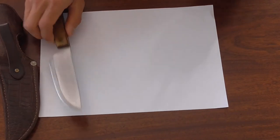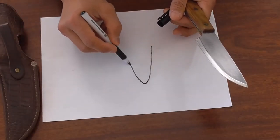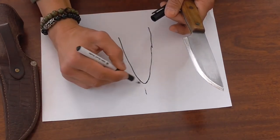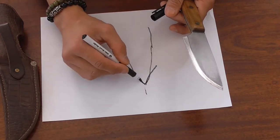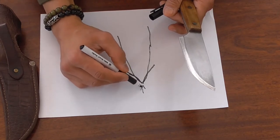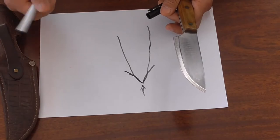When the blade is blunt, if we're looking at it straight into the blade, so if we think of the blade like that, the edge there has been rounded off or damaged. So what I'm going to do is use a grinder to take a bit of metal out and shape it in that shape, and then I'm going to finish it with a stone to fine-tune that point, and then finish it off with one of those steels to fine-tune it.